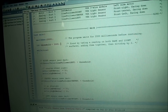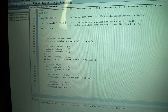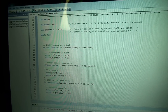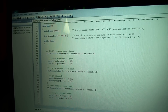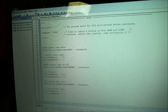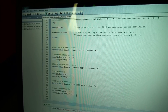Simple program written in Robot C. We determine our threshold, which was 3000 — calculated by adding the value of a light reading plus the value of a dark reading and dividing it by two. Then we have simple if statements that will guide the robot depending on what each line follower reads.